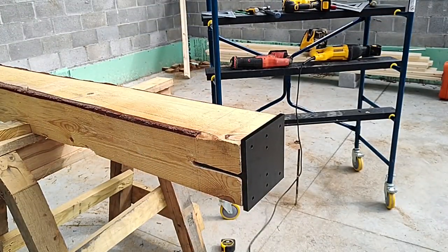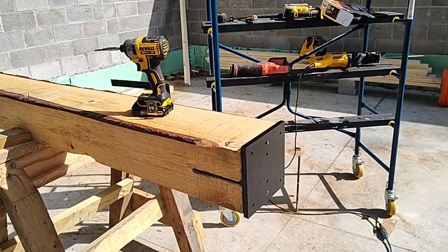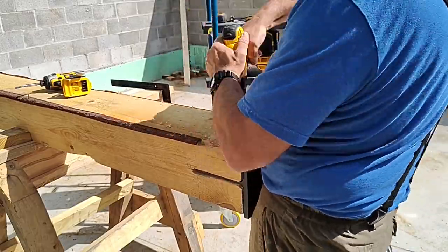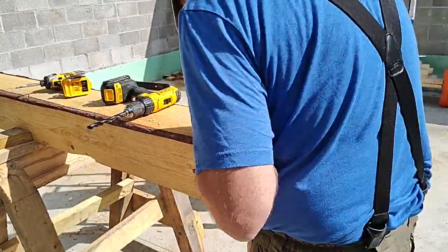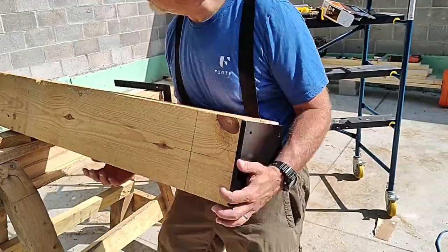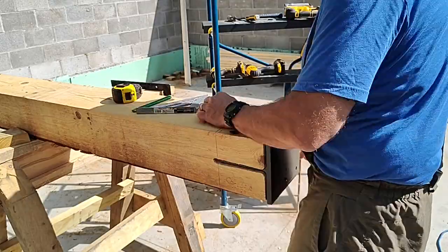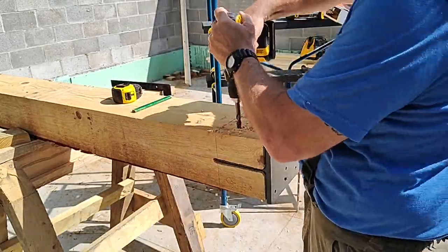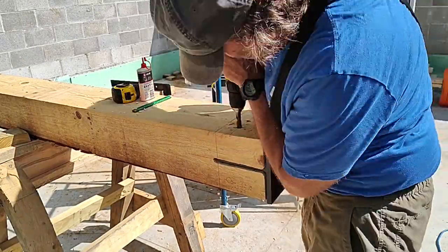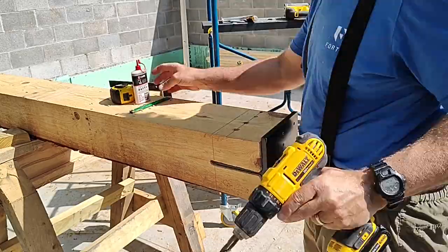Now that we have a good fit on the knife plate, I'm going to do some measurements for the peg holes. I have a half-inch drill bit here that's good for wood or metal. Next time I go to town I'm going to get a 10-inch auger bit. Having only a six-inch drill bit means I have to drill three separate holes on each side heading into the knife plate, because the bit won't penetrate the entire timber. If you measure correctly and drill straight that's not a big deal, but as most of you know, it's a little difficult to guarantee quality control at that point.